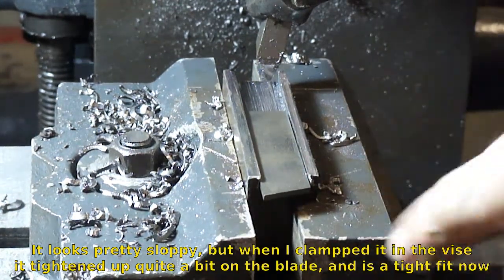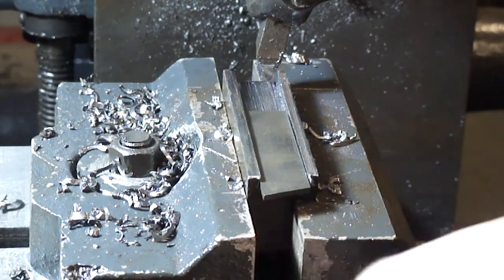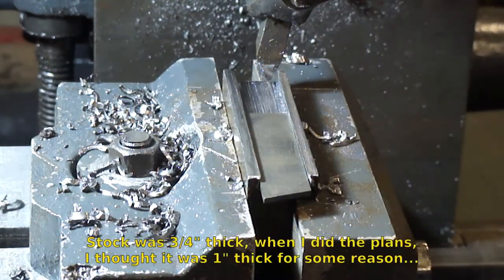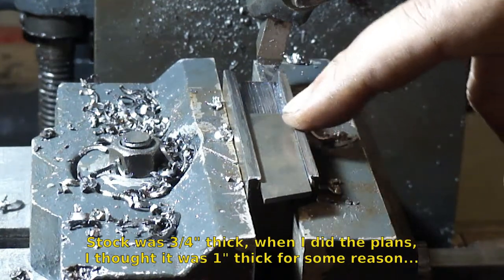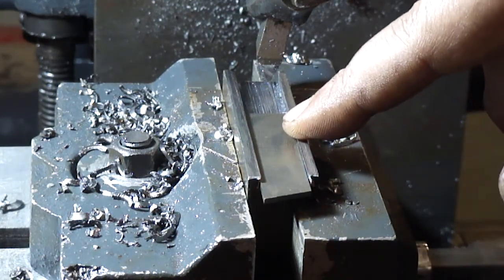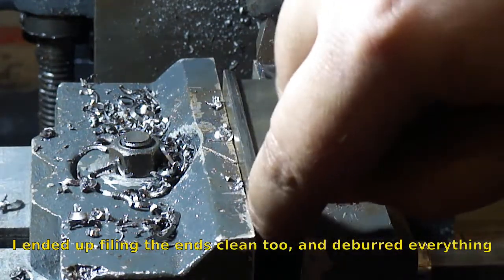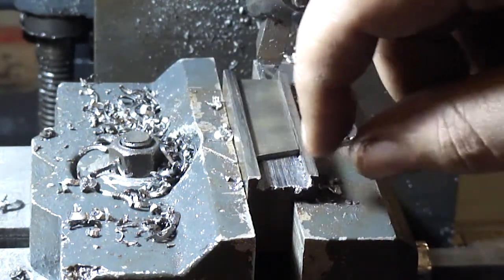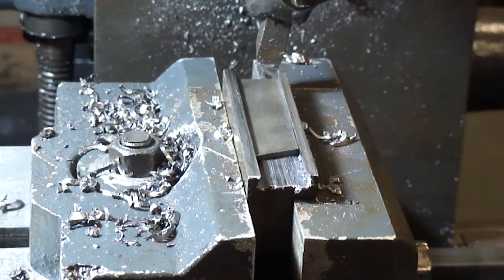Now I'll drill a hole straight down through the middle of this part here after I measure everything out again, because I made a slight miscalculation in planning. I draw filed all the sides except for the ends, which I'm planning on cutting down to size anyway. I'll drill a hole straight down through the middle for a compression point so it doesn't create a weak point, then stick it on the saw and cut right down through it to that hole.